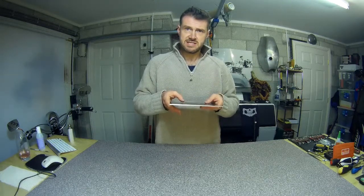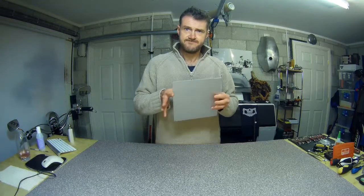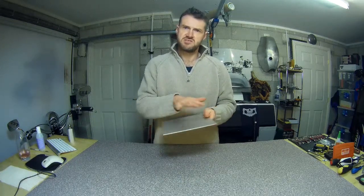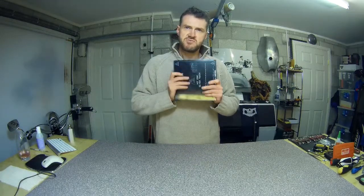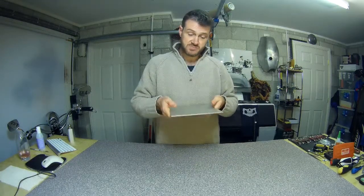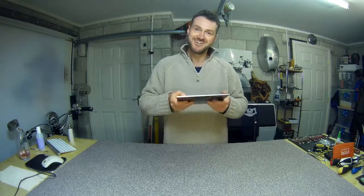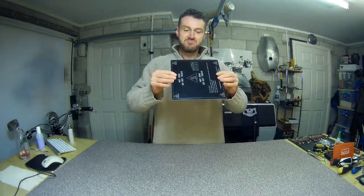So it needs to be lifted up and ideally forced flat as much as possible. I know I have automatic bed compensation that scans around, but I prefer to try and get it as flat as possible to begin with so it doesn't need to do so much compensation.